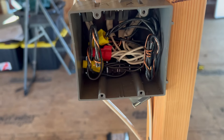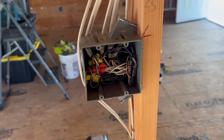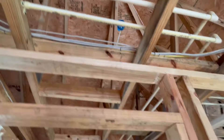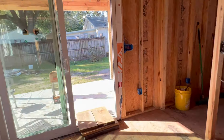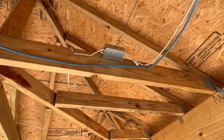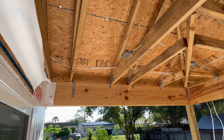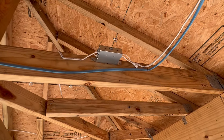This is for the closet and attic — I don't want to have to pull a chain. If I want the attic light on, I'm going to switch it from down here, then go up in the attic. I want to be able to see what's up there. Got some LED disc lights out here and a fan — I have the boxes already mounted. It's going to be difficult to mount these later when you cut a hole in drywall, so I have them mounted now. I'm taking note of where I planned on putting these holes, so at trim time I'll mark the center, cut the hole, and they should reach.